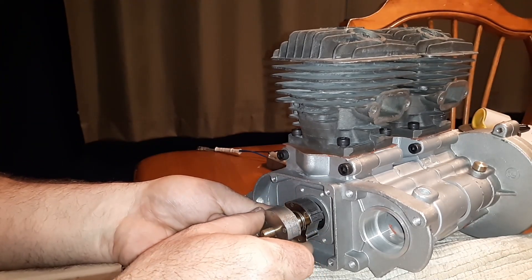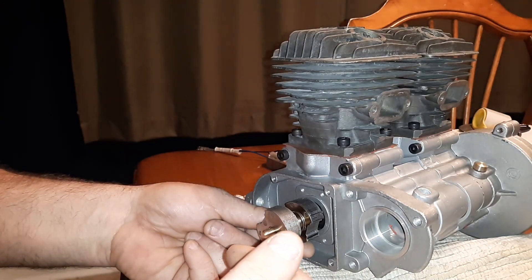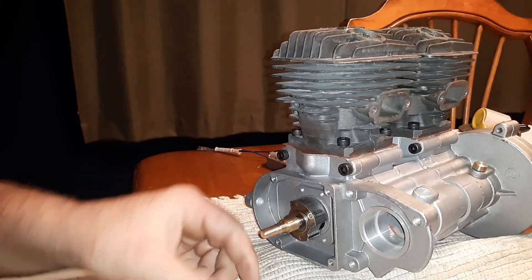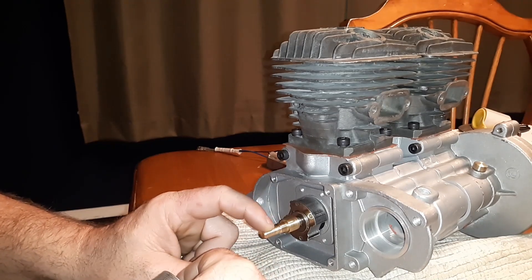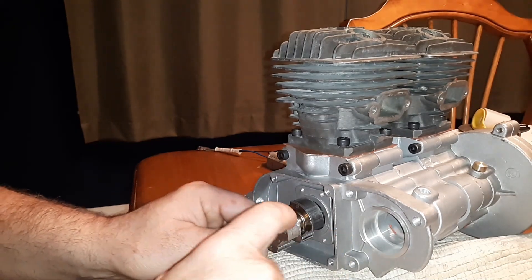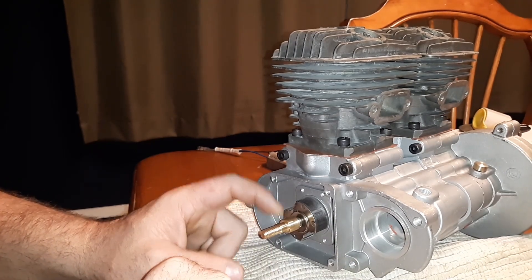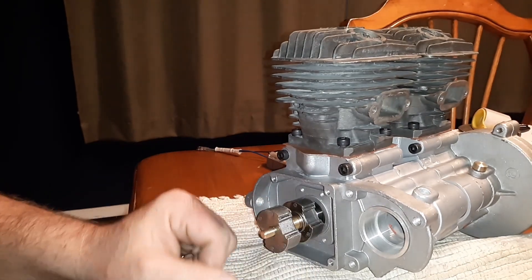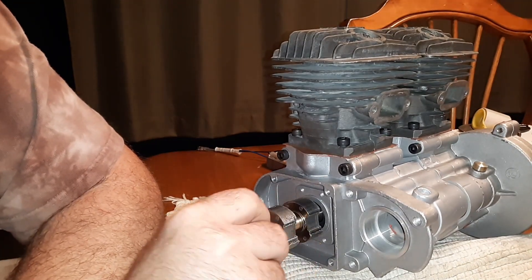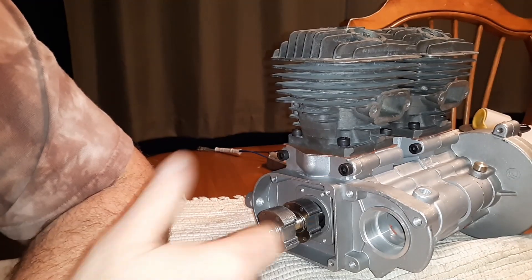It'll probably be something like that, because this is 3.5 degrees different than the other one, and that's done on purpose. Once I know where it's going to be tight each time, I will set it to where it needs to be, mark it, and cut a Woodruff key slot in it so that this is on perfectly each time. These will always be aligned with each other, and this will get two of these and a nut. That's how the magnets will be.